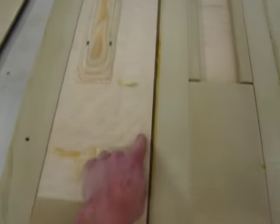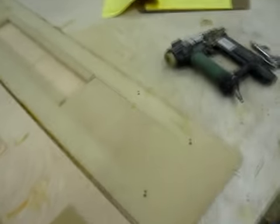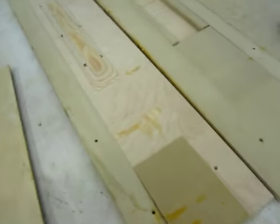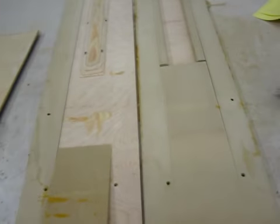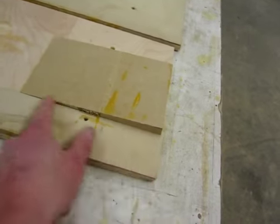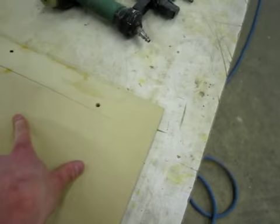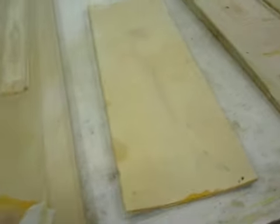For instance, this press here — you can see it's missing the side concave. That's because it fell off since it's not glued on. What that allows us to do is, if something breaks or gets glued to the board being pressed, it's really easy to just pop it apart. It also allows us to make changes really easily. On this one, I actually put a five-degree wedge on the press for one of the last boards I made. These two presses are twins — I made them at the same time — but this one has a half-inch concave and this one is a three-quarter-inch concave. All the boards I made were made on these two presses.